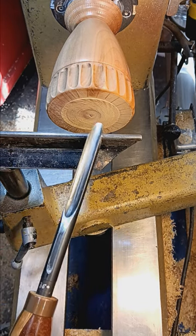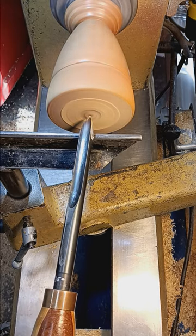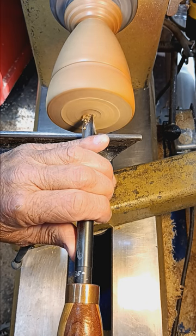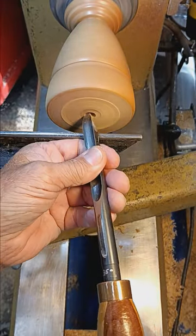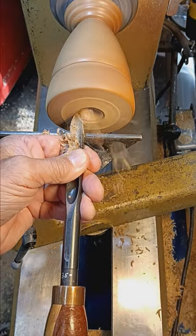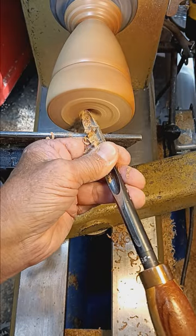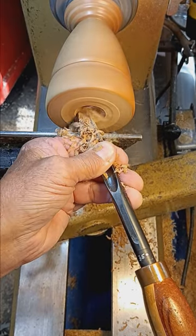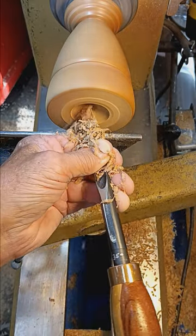I'm probably running about 1500 RPM. You have to go exactly in the center — if you go in the center, it works like a drill and I can actually push it straight in. I've got the flute pointed toward the left and I'm cutting like this. Now you don't want to cut straight across; you can, but that creates the most chatter — it really fights you when you do that. You're much better off to cut at about 45 degrees. Each time I push in a little further, then pull it out.